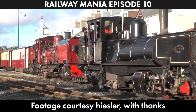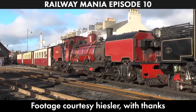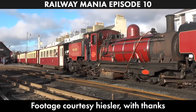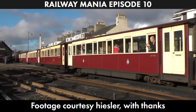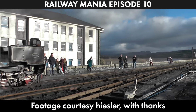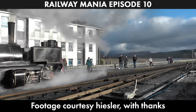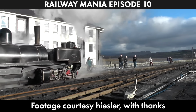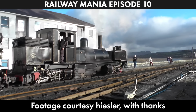Essentially, yes. They'll be fighting with each other almost. It can come to a point where they fight each other because of the way they work, one is going backwards and one is going forwards. So the forward engine would drop further into gear, whilst the rear engine would come closer to mid gear. Or one end would be doing more work than the other end. So to try and keep those in balance, you need all those links to be in tip-top condition.